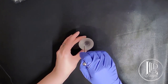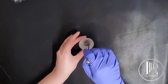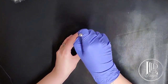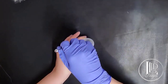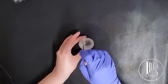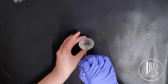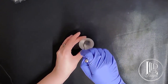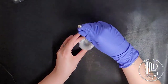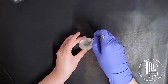About a year ago I started doing flood coats when I was having issues with fish eyes, which was an environmental issue — I had too much humidity in my workshop. What I found was when I added a flood coat, it eliminated the fish eyes. I think that had to do with the fact that the original coat of epoxy was still tacky, so it kind of prevented the top coat from pulling away. The flood coat also helped get rid of anything that was maybe left behind. Obviously if you have something visible like a hair or stray piece of contamination, you'll still see that. But if you don't have anything visible, this will help get rid of those unexplainable imperfections.